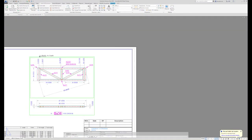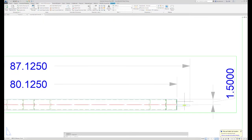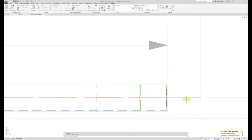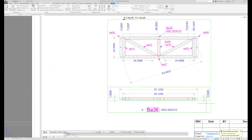Next, we'll look at our other bottom view below, and it also references the overall length of the tube steel frame, and then it has the overall length of the entire assembly with the accessory shear tabs installed. And then another important dimension would be, as I referenced earlier, the shear tab is set on one side from center of tube, which is 1.5 inches, and I have also included that dimension.